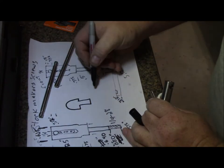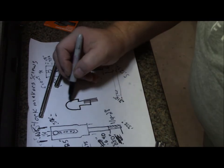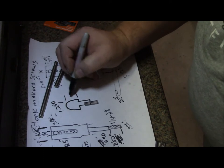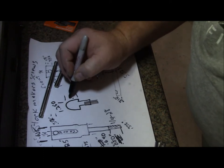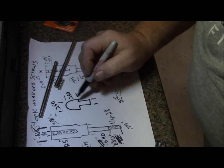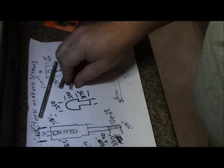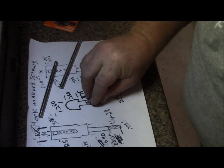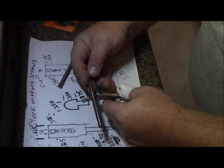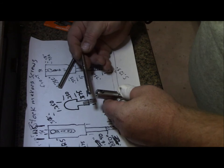The custom pin will be a pilot with a spot in it to fit inside the spring, then I'll make it quarter-inch, and the outer section will be about quarter-inch as well. I'll spin it down to about three-eighths and then turn it down until the spring fits on it. That'll put upward pressure and hit this step right here, keeping it centered, and also prevent it from falling off the end when it hits the slot.